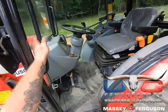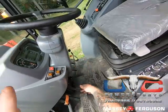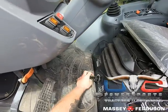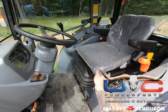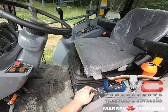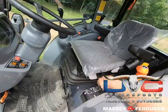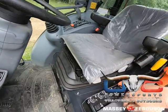Now we're going to step into the cab. These are your brakes, and this releases your brakes. This tilts the steering wheel with your foot — that's a nice addition. This is your differential lock. Different implements are heavier than others, so if you want it to drop slower, you screw it in; if you want it to drop faster, you screw it out — it's a quick on-the-fly adjustment. You have an air ride seat, and you've also got cruise control, which acts as your max speed limiter — you can go super fast or slow it way down for a young or inexperienced driver.